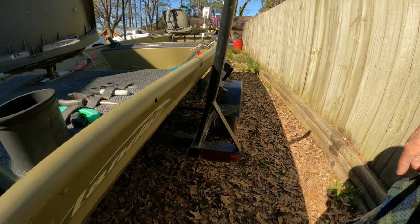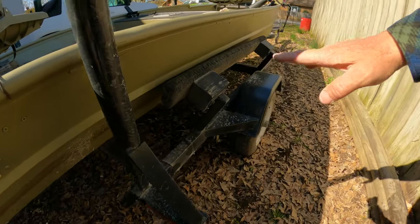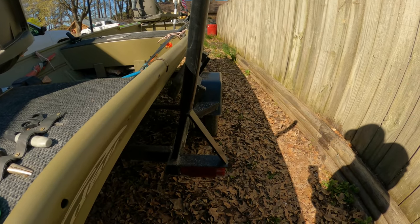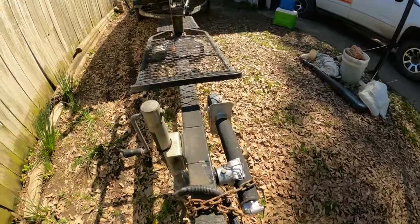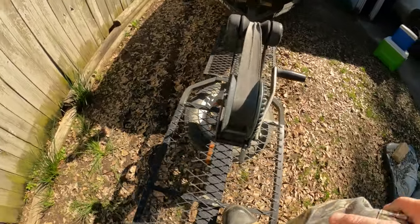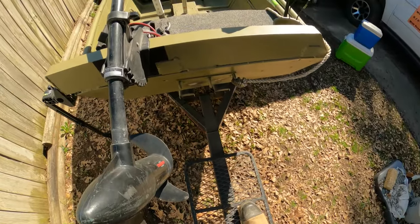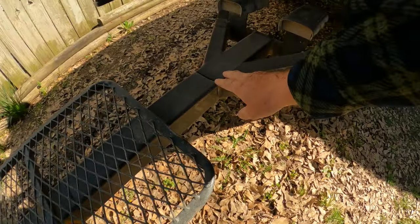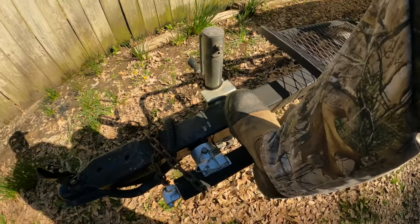My son welded these brackets on the back here — really strong, good for the river. When you get in some current and your boat drifts off your trailer, even when the guides are down under water, the boat will try to drift over the top of them. But if you got these runners, you can stop that and the current will pull you right in and keep you guided straight. My son also welded a jack on here and these platforms so I can get up and walk around and winch my boat. I got grip tape all the way down on everything — on the platforms and the jacks — so I don't slip and slide anywhere.